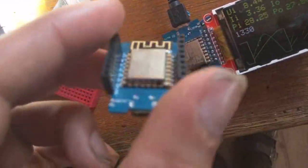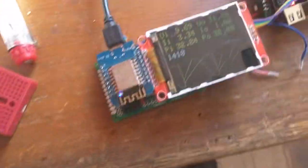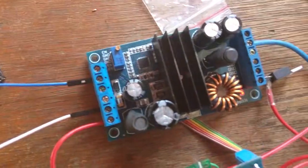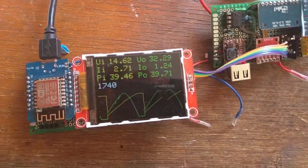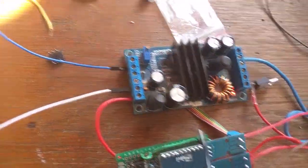The female headers face upward so people can add more stuff and reprogram it — it could be a universal DC converter with full control of voltage and current. I don't really like the MPPT chargers you can buy from China. They're optimized and built for full sun at 200 watts, but when a cloud comes and it's only 20 watts, I've never found one that really works nicely.